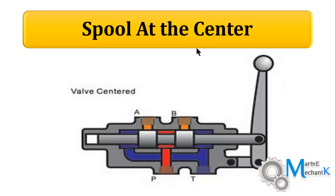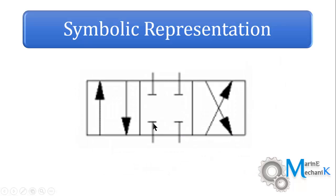With the lever at its central position, the high pressure oil from the pump just stays and slightly leaks past, then drains back to the tank. This slight leakage is allowed as per the grooves on the valve. However, ports A and B are completely disconnected so that no oil goes to the system to do any work. Ports A, B, and T are all disconnected — nothing happens in the system.